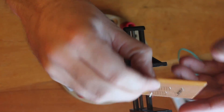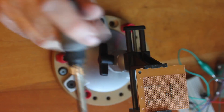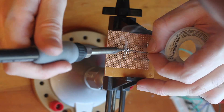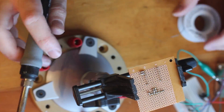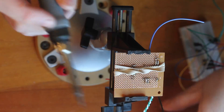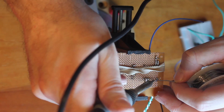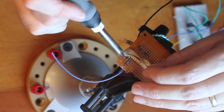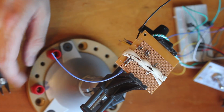So we're going to do the ground wire first. I got that laid out, put it in here and solder that in. The way this board is laid out, none of these pads are connected — it's not like they're in rows. So I just have to connect them with some solder. That's good enough for the ground and the power. Now we just have to do that for the other connections. I'm soldering on the wires for the relay last here — just got to do the ground, then the signal wire, then the power wire over here at 5 volts. And then just clip the leads off that are sticking out. I'm not going to cut the pins off just in case I want to ever take that out and use it for something else.